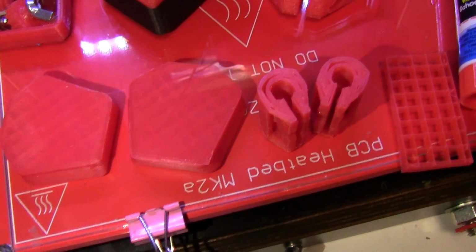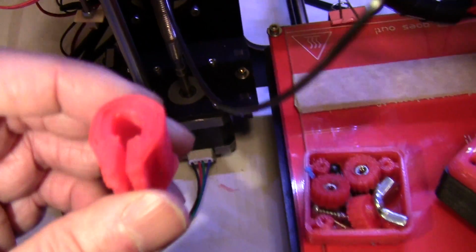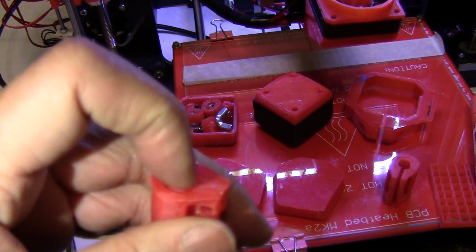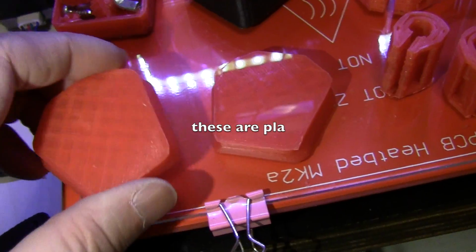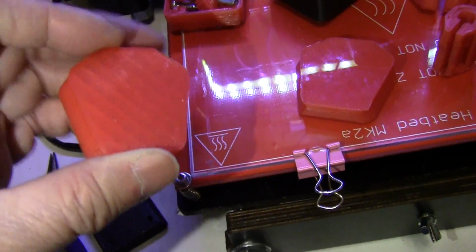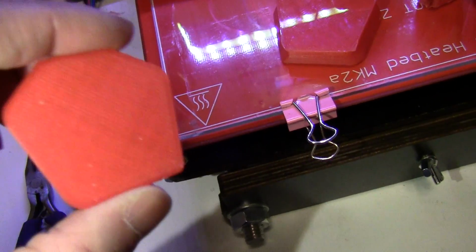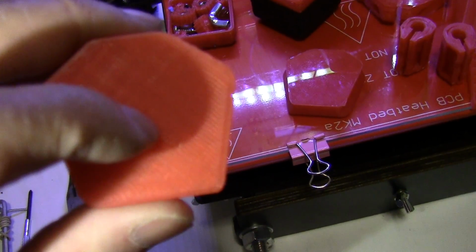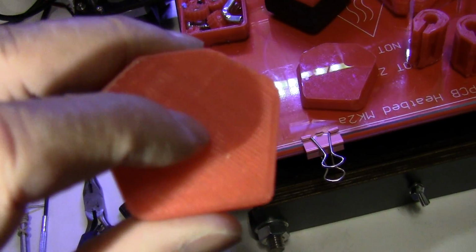And these are some of the other materials I printed. This is the Z support or coupler, 5mm to 8mm. This side I probably have to drill it out a little bit, using a 5mm drill bit. And I think I showed you this before. I printed it on the glass, so it came out very smooth, kind of glossy, so that's good. All I have to do is drill a hole and put a 1/4 inch, maybe like a pan head screw on it.